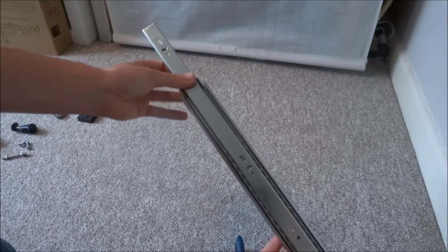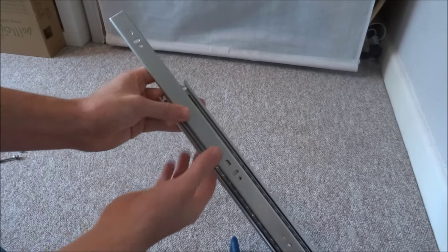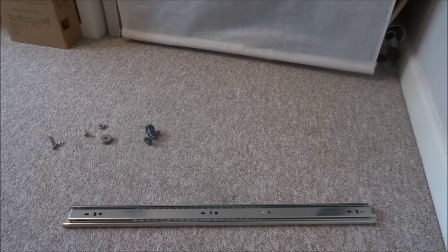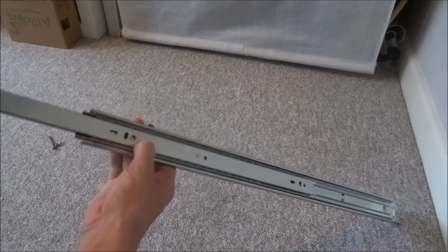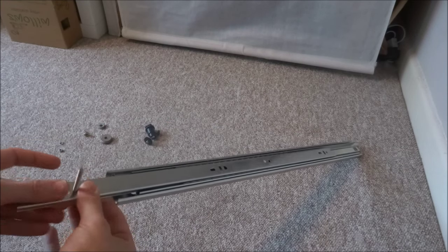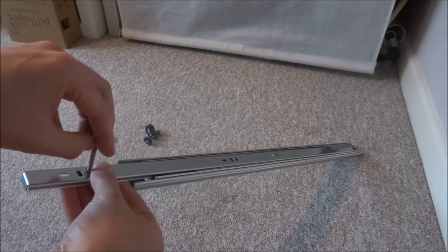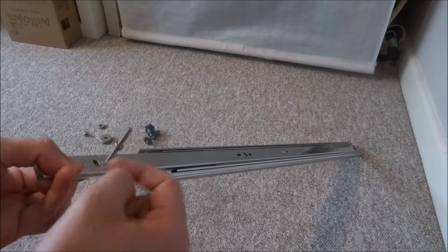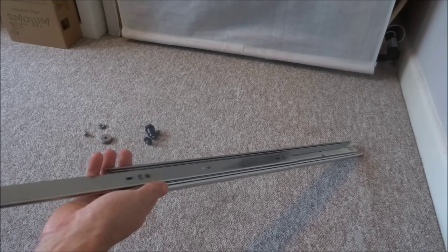Now we've prepped the mechanism, take the sides out and drill two holes slightly bigger — one for the handle and one for the base. I've pre-drilled those holes to six mil. We'll start with the handle: put the screw through, then a washer. You could make this look much nicer with a smaller screw and a plastic handle, but since I'm only using this once or twice I'm not too bothered what it looks like.